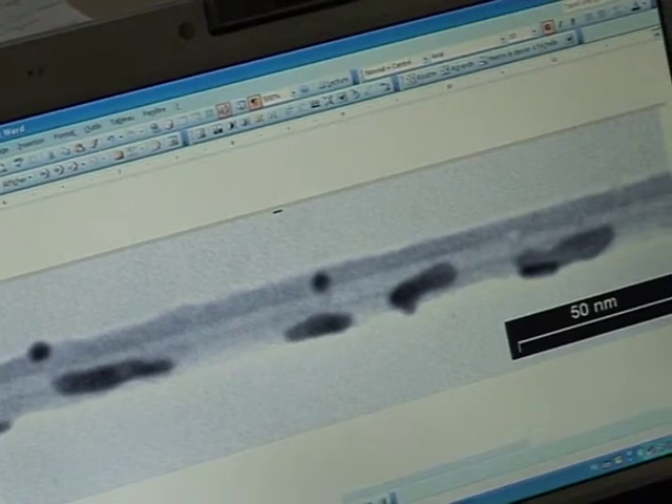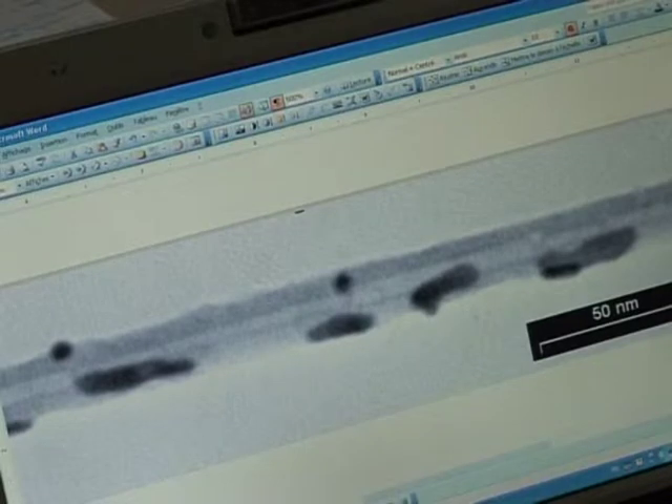When we test the sensor based on gold, it doesn't work — no resistance change. The trouble is that if we just put the metal on the nanotubes it forms these large particles, and that's not very good for gas detecting.